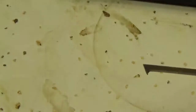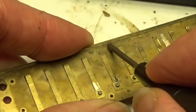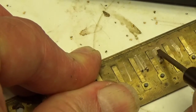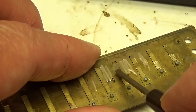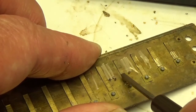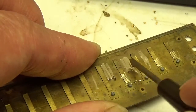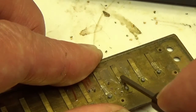This will give you a tool that is super sharp and will peel off a nice little ribbon of brass. If you line it up just right, you get a pretty wide ribbon of brass. And when you use it on reeds, you get these nice little streaks that break up the mill marks on the reed. They actually make the reed last longer because it breaks up those mill marks that are going sideways on the reed. So it's a very, very safe way to drop the pitch on a reed.